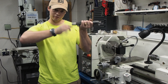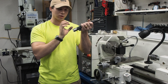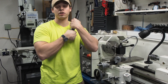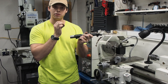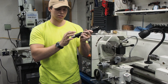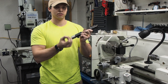Basically, you can just take your fingers and flick your wrist like this and it'll spin on and it'll actually hit the shoulder. And once it engages, it'll take a huge amount of force to untorque it again. The reason why is because those threads are cut so perfectly straight and so perfectly smooth that when it engages with the shoulder, every surface area is in 100% contact — it's almost like suction.